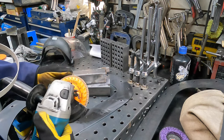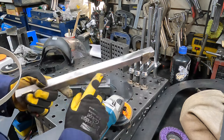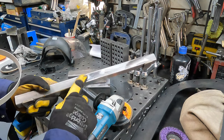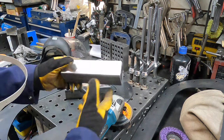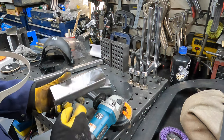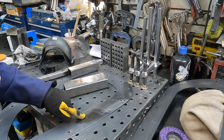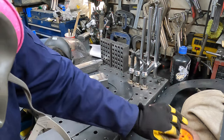That wasn't good at all. This is a 40-grit wheel, so it's getting after it a little bit, but it was still struggling even on the tube. You can see it just bit into the edge and started rounding the tube over — definitely a no-no. On the top surface it's not removing the mill scale very well at all and it's polishing the surface. On the heavier mill scale I ran it a little longer but there is still polished mill scale remaining. At the corner of the 2x3 section it wasn't even getting close to breaking through, and on the heavy plate it's just riding over the surface, not cutting in at all. Save it for grinding steel.